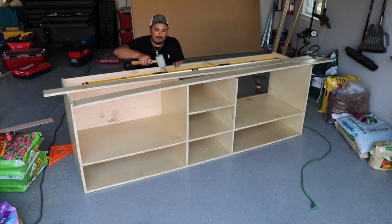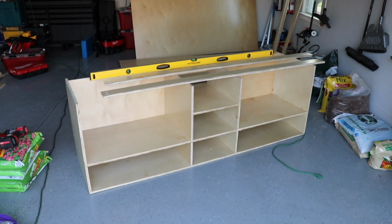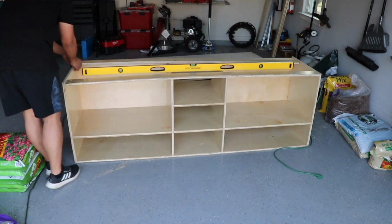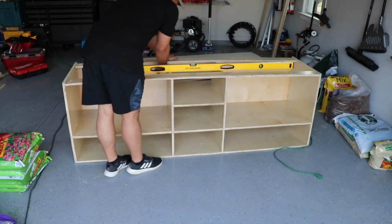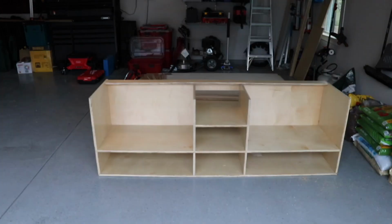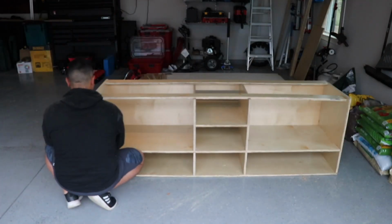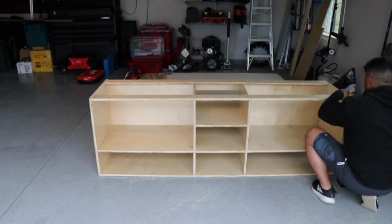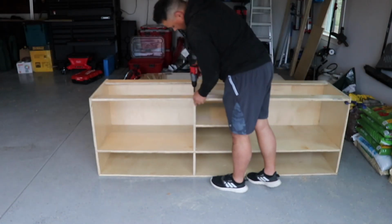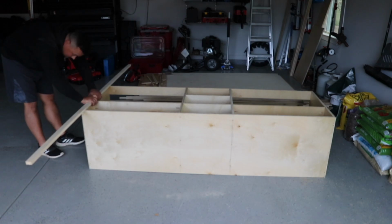I think that was where I saw when I 3D CAD'd this up. I had obviously the design laid out and everything, but I ended up changing something when we were doing the dados, so I didn't transfer that over to my 3D CAD piece, and that ended up causing me a little bit of headache as I was moving through the project because there were all these little pieces. I think it was the dado that I added to kind of sink the cabinet in, and then I did not dado the bottom long panel, the centerpiece, and I was supposed to.